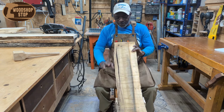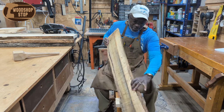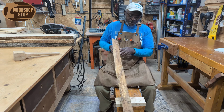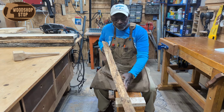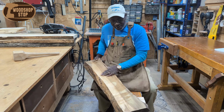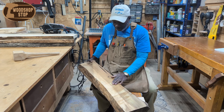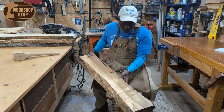So we'll have equal thickness all along this board on both sides. So it'll be equal all the way around. And we'll probably end up with 2 inches maybe. I'm guessing. That's kind of what I've been running into, about 2 inches finished thickness, which is 8/4, and which is a good size to work with. I could actually resaw that down if I wanted to, and have twice as many boards. But I'll show you how I get started on taking these high areas down.